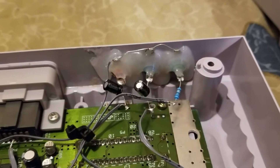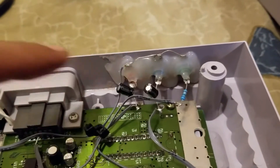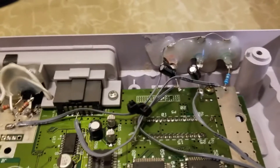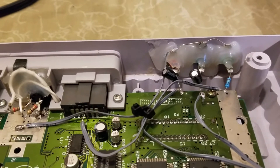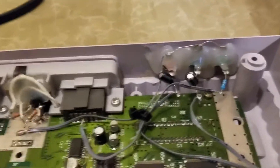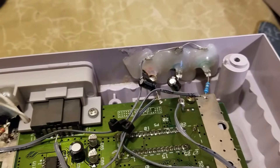Here's the circuit — it's very simple. The component mod circuit is just two 2-microfarad capacitors coming from pins 1 and 24 of the S-ENC video encoder, and one resistor for luma coming from pin 7 of the multi-out, which is luma for both composite and S-Video.